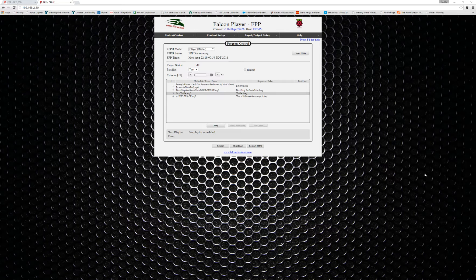I've been playing around with my P10 and different footage, and I'm back in East Texas already. For the most part if you're just looking at color graphics on there it looks fine, but as soon as you start putting some video content on there with dynamic range that varies, it starts looking muddled or it might look really washed out. And these P10 panels are hella bright, so we have to control that a little bit. I've been messing around with dimming curves and just bringing the brightness down.